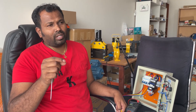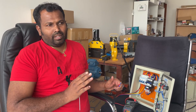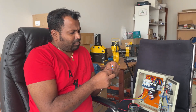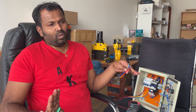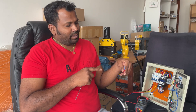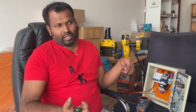The insulation test checks whether the motor winding is okay or shorted with earth. The resistance test checks whether the winding coils are shorted with each other. In a three-phase motor there are three coils, and each coil will have one resistance value. All three coils should show the same value — if they do, the winding is okay. Then we do the insulation test.